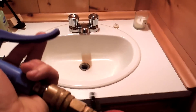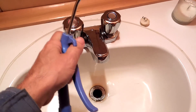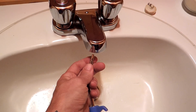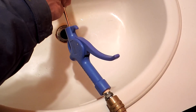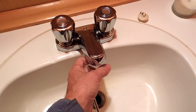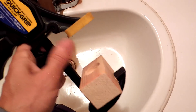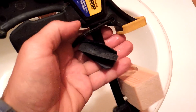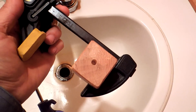Going to the bathroom, I need to open the hot water tap and inject some compressed air into the hot water tank from the top. You can inject compressed air just by holding the end of the fitting tightly on there and squeezing the trigger, but I don't have a spare hand for this, so I have this homemade fitting. That hole there fits over the end of the faucet with some rubber gaskets made from inner tube, and the nozzle plugs into this hole here.